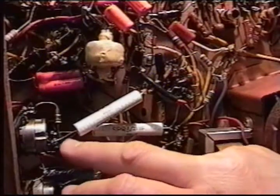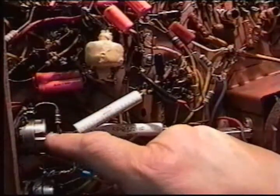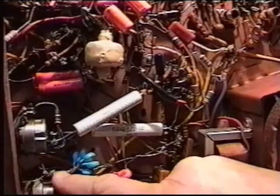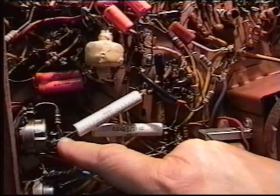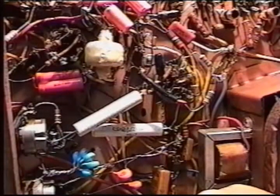The voltage on this end is about three to four hundred volts. This is the high tension end here — that's the part we really need to worry about, that everything is dressed properly. Being that these are all at the same potential — they're all six thousand volts above ground, with the chassis as ground. The difference between capacitors is maybe forty or fifty volts, but the difference between here and the ground chassis would be about six thousand, five hundred volts or thereabouts. So we are looking good.